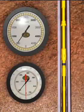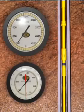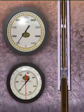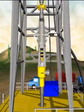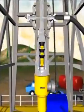We are now ready to perform the cement job. The cementing company rigs up specialized blending equipment and pressure tests their pumps and surface lines. Once the cement is mixed and the properties are tested, it is pumped down the drill pipe and into the liner. At the surface, the cement is pumped through a cementing line into the TD swivel port.